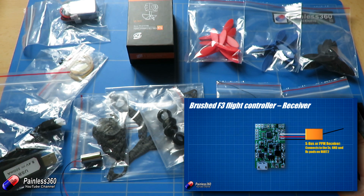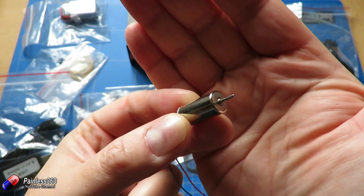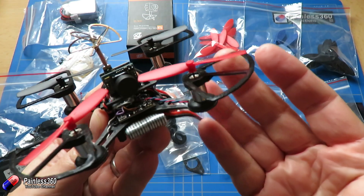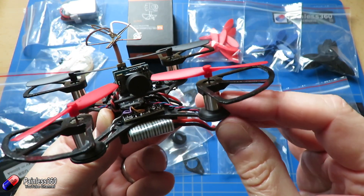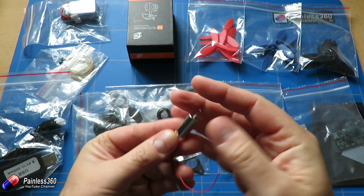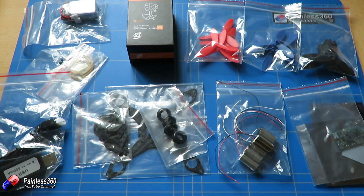This one might not just be an indoor flyer because it's going to be running on 2S batteries. It's also going to use these little motors here - these are 10x20 motors, significantly bigger than a lot of the motors we're using on some of the other indoor quads. It's quite typical to have 8.5x20mm motors, but these 10x20s are a lot bigger. The props are larger and this little guy runs 2S. Interestingly, looking at the motor specs they don't talk about supporting 2S, so I'm fascinated to see how it performs when it's all together.